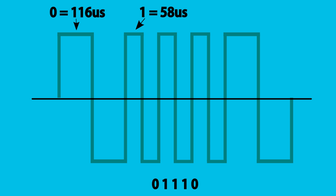The booster creates what they're calling a binary on or high, or off which is a low signal, applied to the power bus, which then goes via the power bus to your track and then to the train, running the train via the DCC decoder. The binary value — the ones and zeros — is determined by the period from one high state to the next. There is full power on the rails at all times, so if you've got 16 volts to your rails, that's what you get. While the booster output is turned on, voltage does not determine the locomotive speed like in the DC and AC world — that's where some of the confusion may lay.